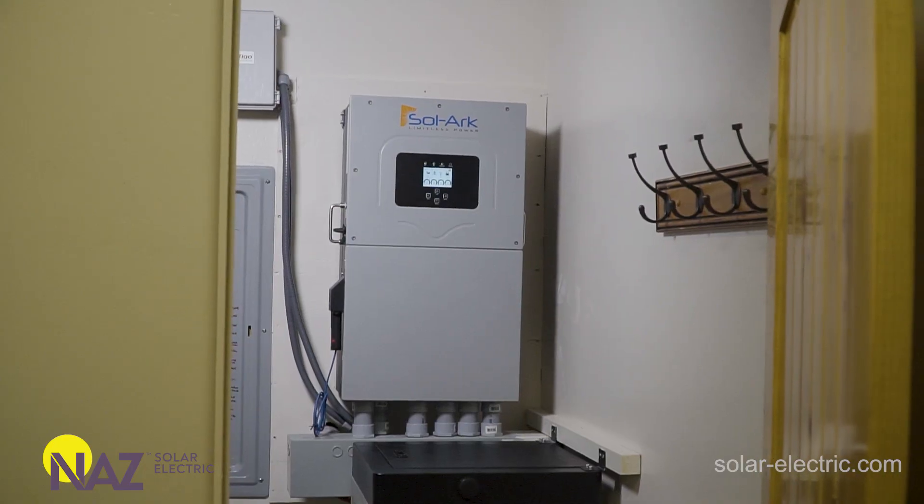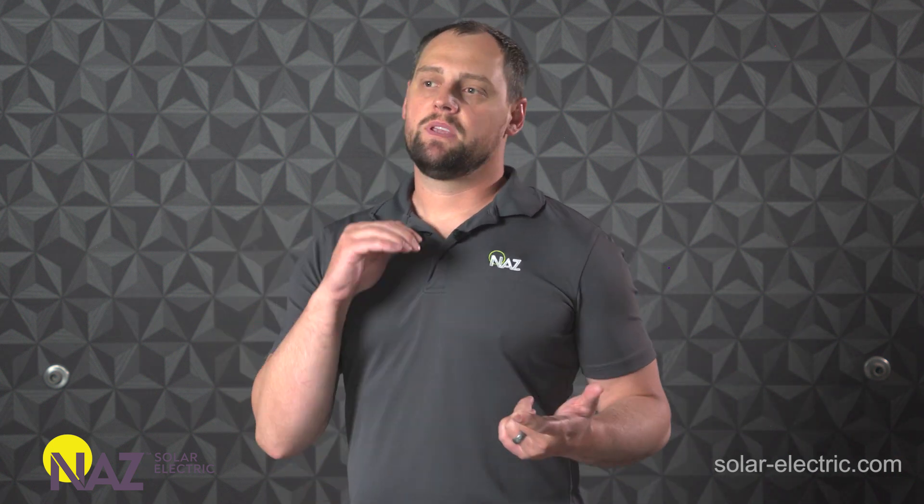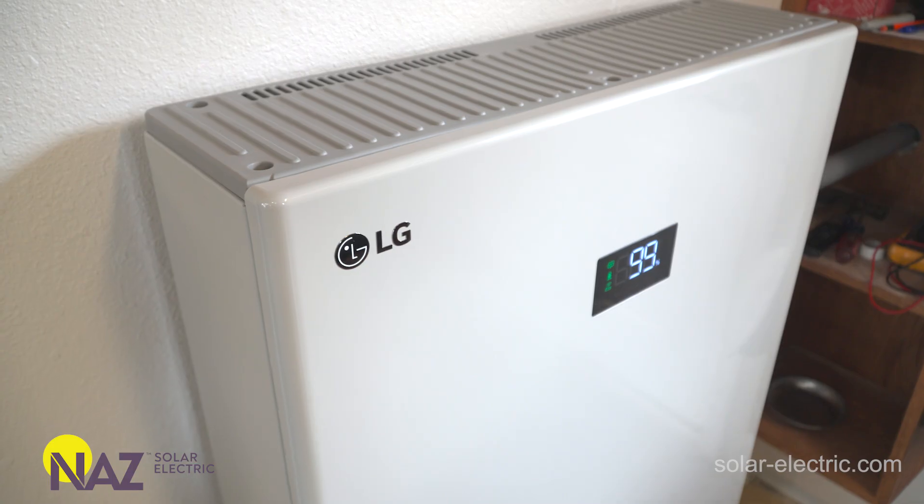As far as equipment is concerned, for the DC plus AC coupled mix we often use solutions like Solark — they're perfectly suited for this and have a specific way of tying in AC coupling very effectively. EP-Cube from Canadian Solar and all sorts of other AIO inverter platforms really allow you to mix AC and DC coupling together. AC-exclusive solutions include AC battery products like the Enphase AC battery, LG Home 8 AC battery, Franklin, and various other AC battery solutions that have to be AC coupled with no DC coupled component — which obviously limits their use case.